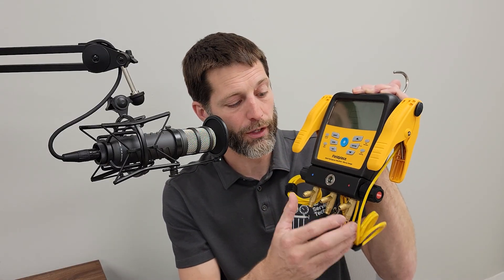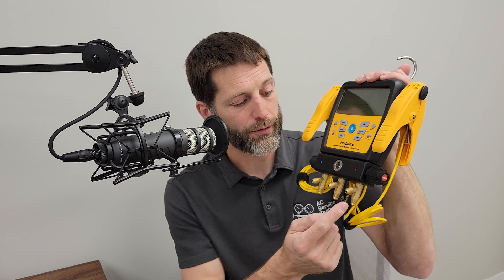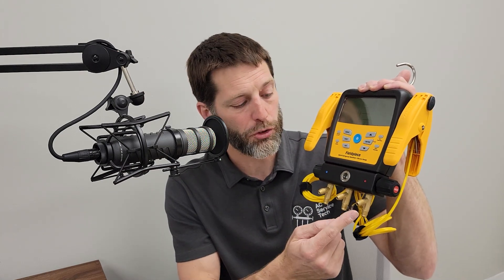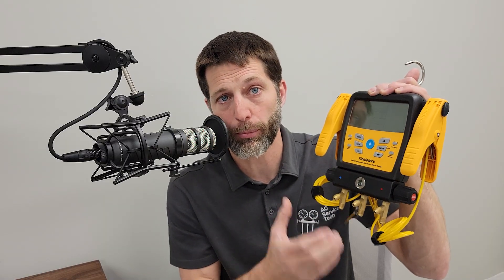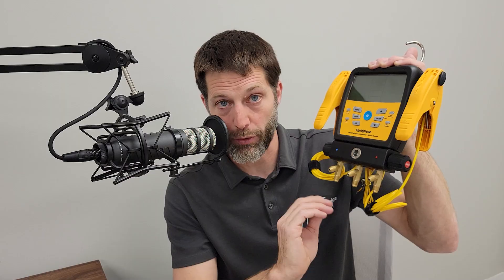The limitation is you're still stuck with refrigerant in the hoses. If you're just checking the charge and not adding refrigerant, that liquid hose is going to fill up with liquid refrigerant. Before disconnecting from the system, you have to charge that liquid back into the low side while the system's running. When you connect, you still have to do the air purging process, and when disconnecting using a manual ball valve or automatic low-loss on the end, you'll have refrigerant trapped in the liquid line that needs to be charged back into the low-pressure side.